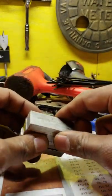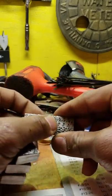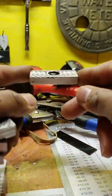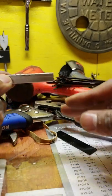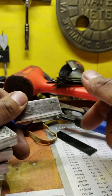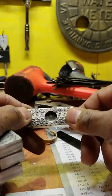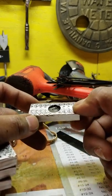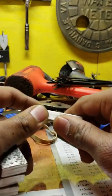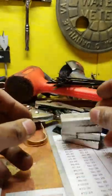We also made magnetic versions of those jaw protectors in the shop. They have a little earth magnet epoxied to the back. You stick them up inside your chuck jaws and they stay put — just slide your workpiece in and tighten down, and it prevents you from leaving marks on the workpiece. You can see the marks are on the back of the aluminum piece instead of on the customer's part, so you don't have to waste time filing out marks on the workpiece itself.